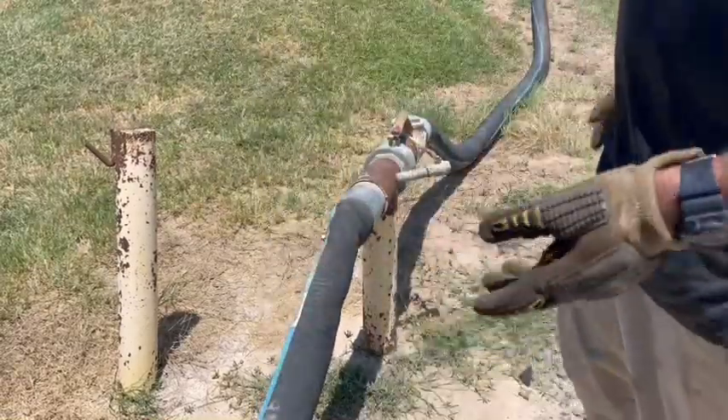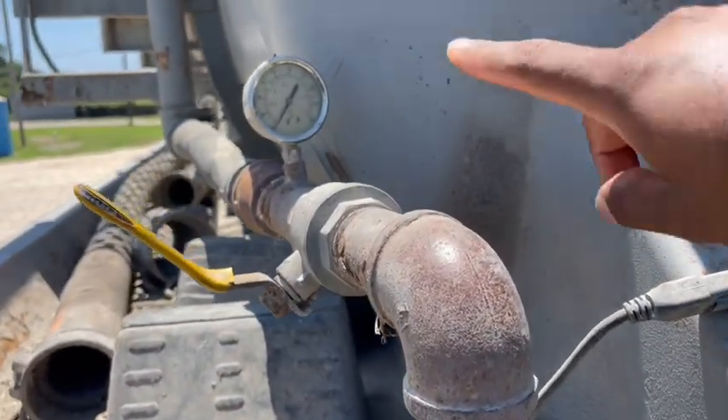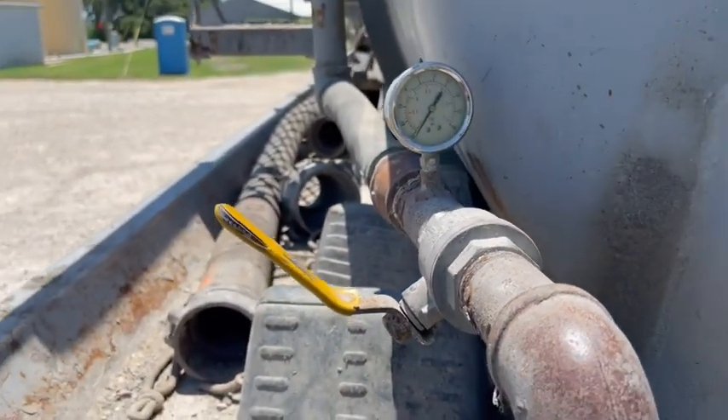We're going to open up this valve here — this is how we get our water in. Now we should be loading. You can see that four-inch hose moving, which means fluid is going in. We are loading. That's the process of hooking up — it's that simple. When you go to a location, you just have a hose inside a tank and you're sucking stuff out, or you're connected into a tank pulling fluid, mud, or water. This is the loading process. My vent line is still closed — we're all the way on 30 but we've got good suction.